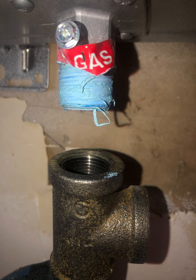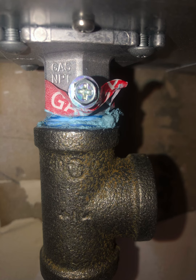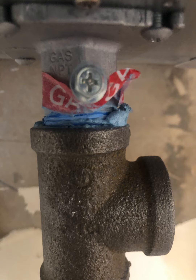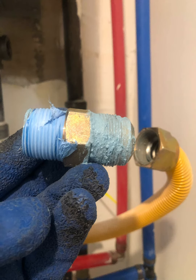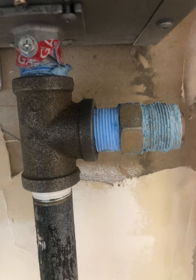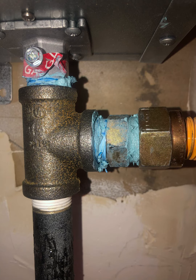One thing to note: when you screw in the pipes, the threading is tapered — it's angled or receding. So the left threads have a smaller diameter than the threads to the right. The threaded part gets bigger and bigger, so it becomes harder and harder to screw in. When you use thread sealant, it acts as a lubricant to allow you to thread the pipes deeper.